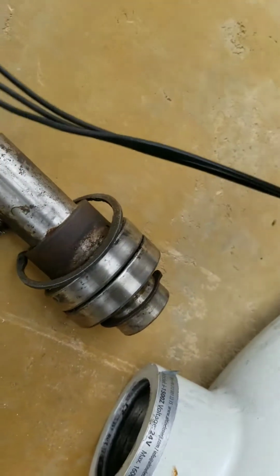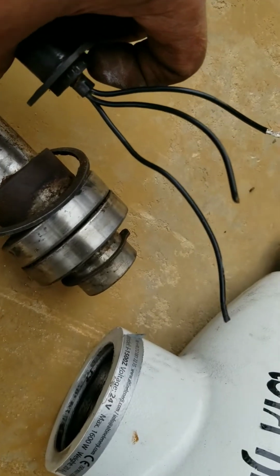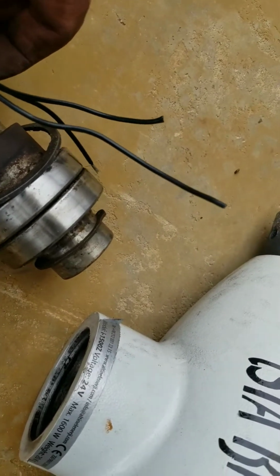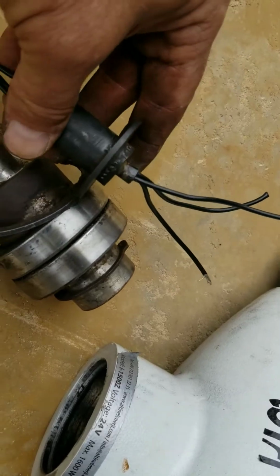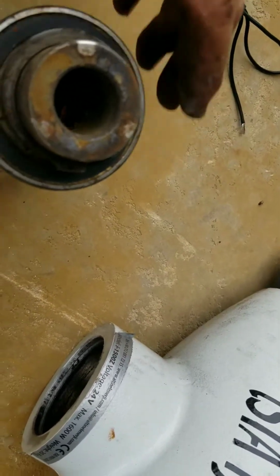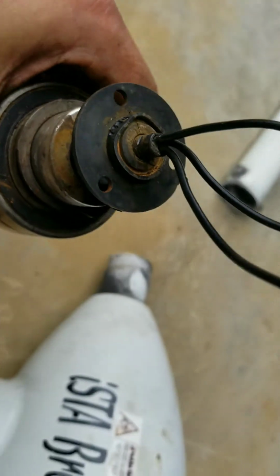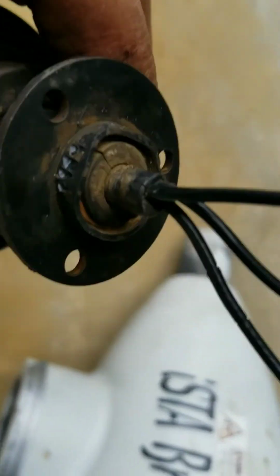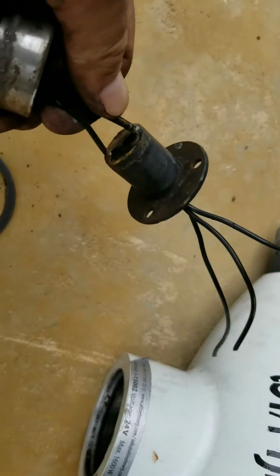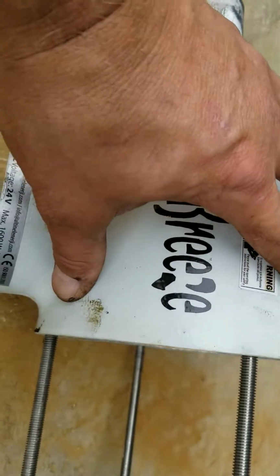The only problem is that this slip ring, and I know for something that's supposed to supply about 40 amps at its peak, these are some pretty tiny wires. I think they're only about 18 gauge. I suspect it's grossly undersized, but the slip ring here fits down inside the mounting stub, like so. And it's driven home in there and seats quite tightly, and it's essentially waterproof. And as you can see, it's potted on the top, potted on the bottom. There's no way, once water starts entering the main body here, that it can leak out.